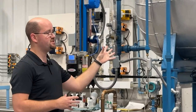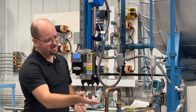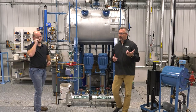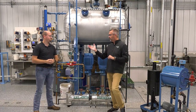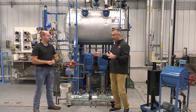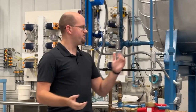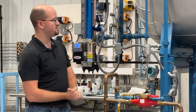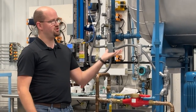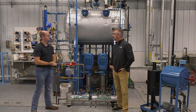So if you've got a small boiler and don't have those concerns or don't want to go through that kind of expense, maybe a cheaper option would be better. In our rental department, we choose deaerators for every trailer. For all of our large boilers, a deaerator is the way to go — it's had a lot more success, it protects our boilers better, and overall you get some efficiency gains by putting higher temperature water into the boiler. We get to keep a little more efficiency and do better for our customers.